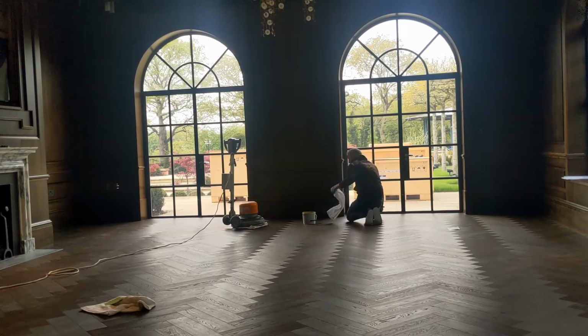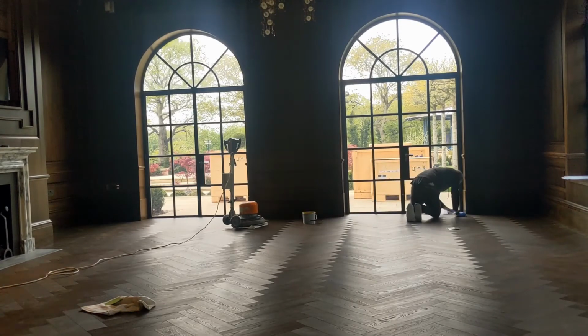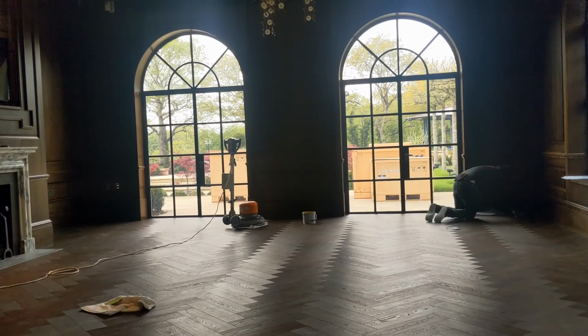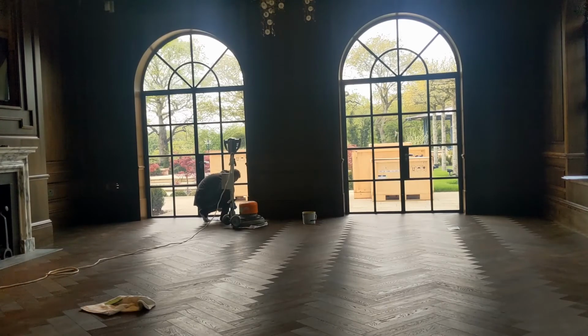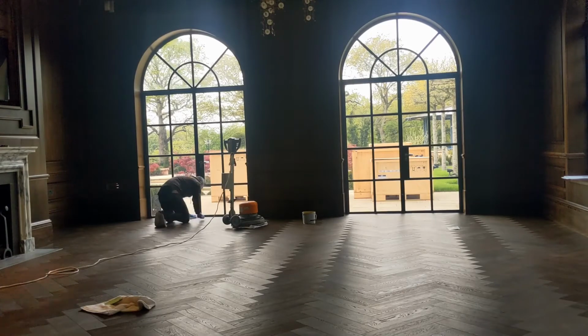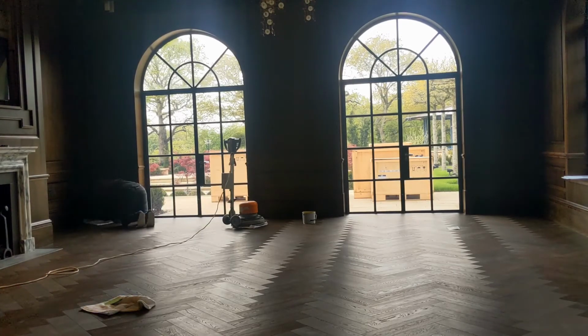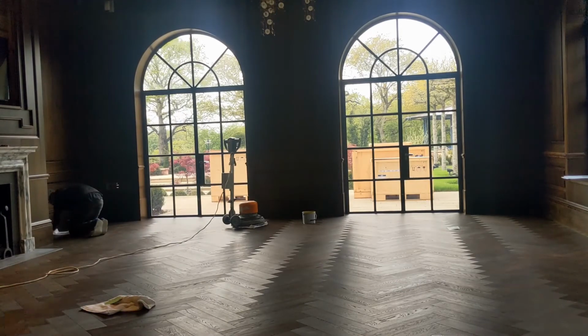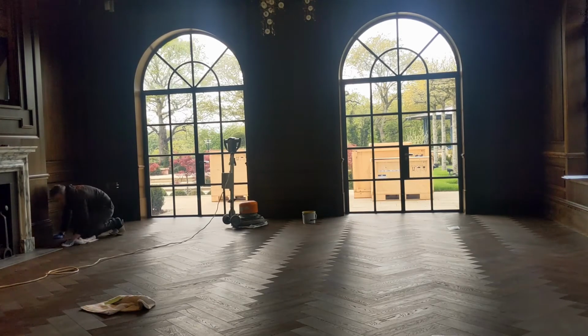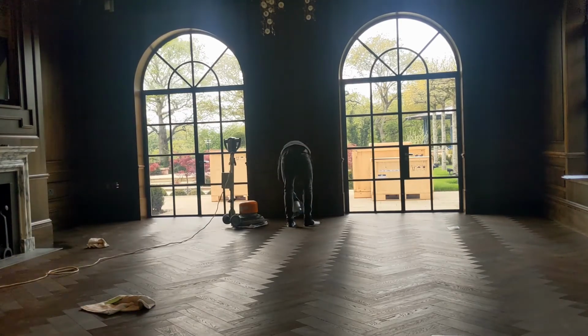is work the oil in to your edges and cut them into the floor about 6 inches in. You can either do this with an oiling cloth, a paintbrush, or the applicator. If you are using an oil that contains colour rather than just the natural oil that we're using here, then make sure you mask everywhere up so you don't change the tone or get any colour onto the woodwork around the edge.